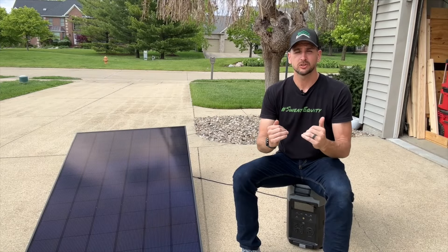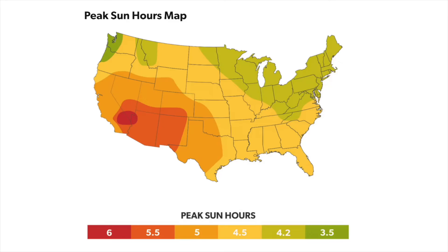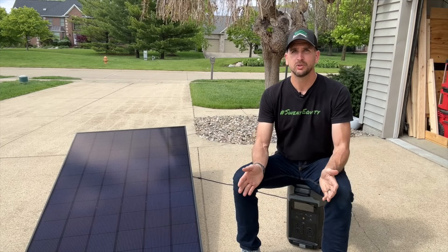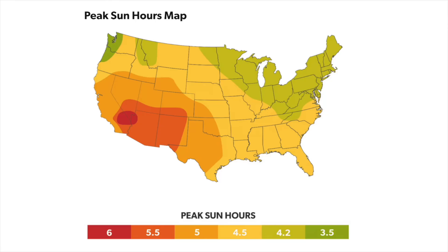For your specific location, we need to understand the number of peak solar hours per day that we multiply by our system rating. For me, that's an 11.3-kilowatt system. Cloud cover and seasons make a huge impact, but you don't have to do all that homework yourself. There's a link in the description to a map showing peak solar hours across the United States. Just because the sun rises and sets doesn't mean your panels produce maximum output all day — really it's only the core hours in the middle of the day, which can be as high as about six hours in southern California or Arizona, or as low as 3.5 hours in the Pacific Northwest like Seattle.